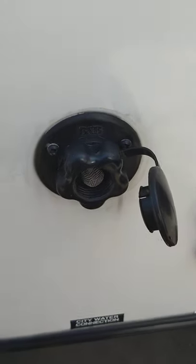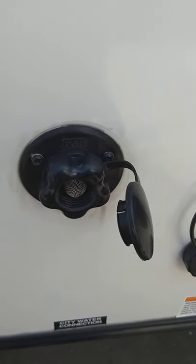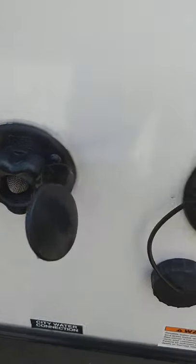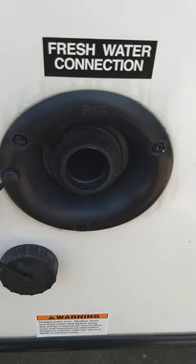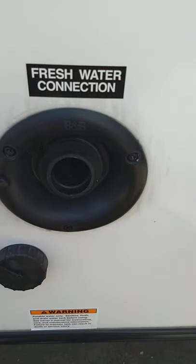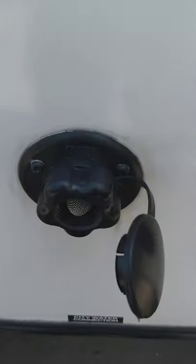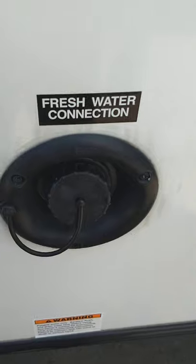This is your city water connection — this is what you're normally going to use to get water to your trailer. You just hook up the city water, turn it on, and the trailer is ready to go. If you go to an older state park that doesn't have plumbing on the campsite but has a fill station, you have an onboard water tank and you can fill it right here, then use the onboard water pump to pressurize the water system and it works just like you have city water.